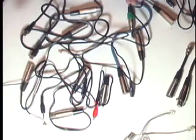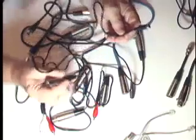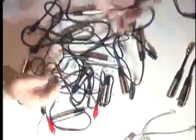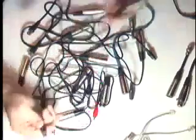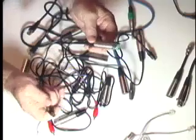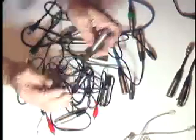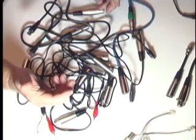I have a cable made up that I use where I start with my S-Video connection off a camera, bring it through a cable, and on the other end take another S-Video connection. But I strip off the luminance in the connector and run it through a black-and-white monitor. On this end it plugs into the switcher, and the cable has an additional cable coming out that runs to a black-and-white TV so I can monitor it there. It works very well. That's a custom-made cable, but you can run S-Video to other sections from one location to another through a mic cable.